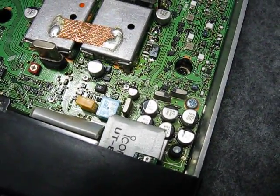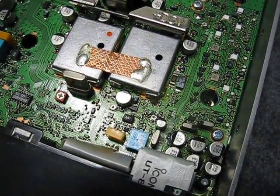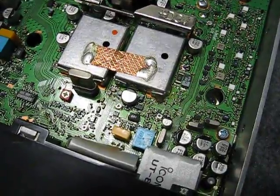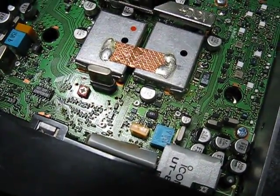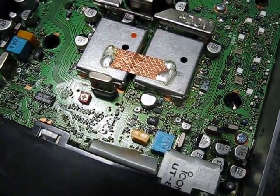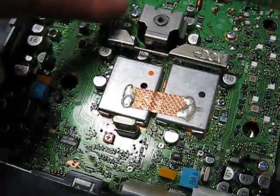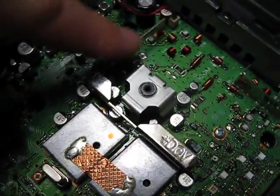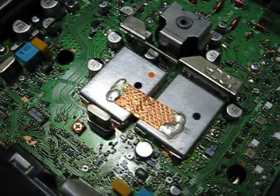So it was a process over a week or so, a couple of weeks, to get everything done. I didn't do it all at once because you had to really strain your eyes to see everything, even with the magnifying glass. And I even had to remove this DC bus bar, which supplies DC power to both UHF modules — that came out as well for easy access.